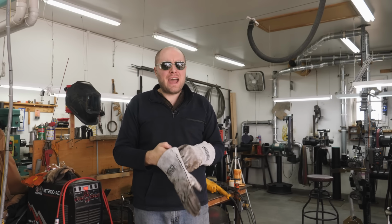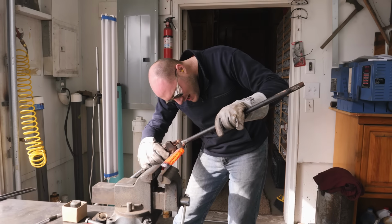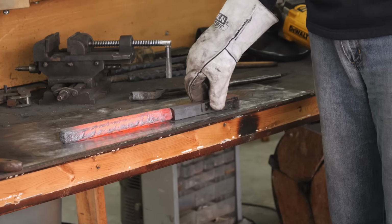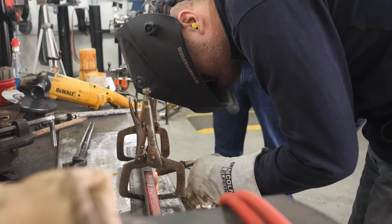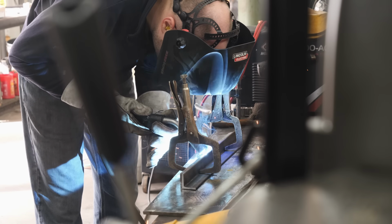I think it'll take about 5 heats to get the bar twisted. This janky old thing is not grabbing onto it at all. This isn't gonna work. I weld a square bar of steel onto our twist billet. This will give me something that's cold outside of the forge that I can grab onto better with my twisting wrench.